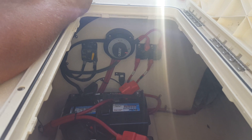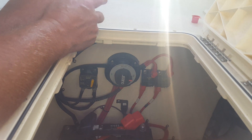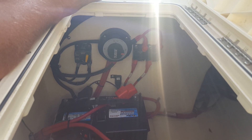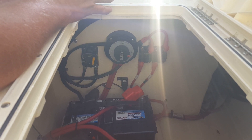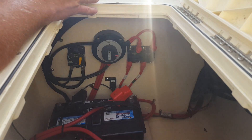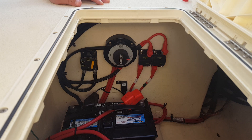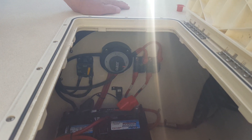That's the reason you do not want to leave your batteries on both when you're running in a new boat. Put it on one or two — save one in case you forget and have a dead battery. So with new boats, you should have it on one or two, not on both. If you're an old guy like me, you had to have them on both in the old days or both batteries wouldn't be charged. Now they're both being charged no matter what your switch position is on, thanks to just better boating technology.